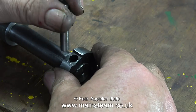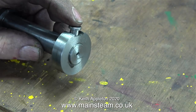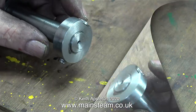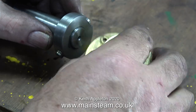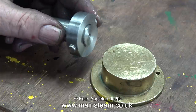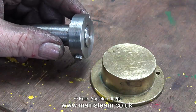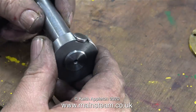This is not a setup — this is literally the first fitting of the pin through the ring and the stub axle. The pin is a firm push fit in the hole. Here you see the principle: the slot that I milled on the top — which I didn't video because I forgot to press record — is a recess that the top of the pin fits into. The pin is slightly too long so I'm going to chop a bit off.